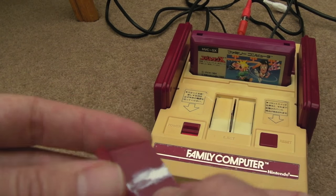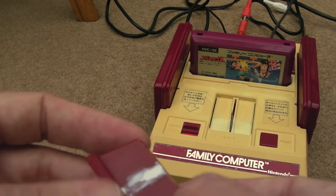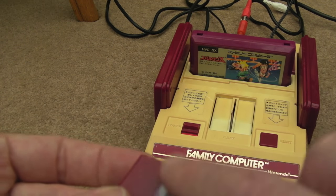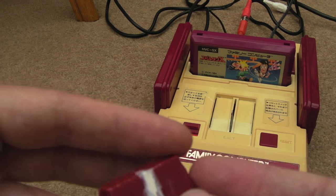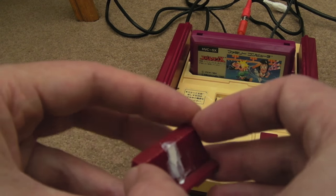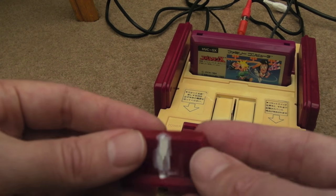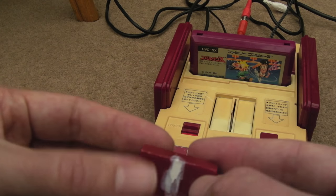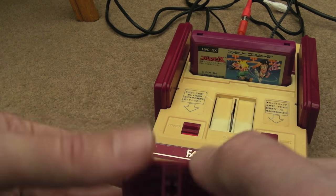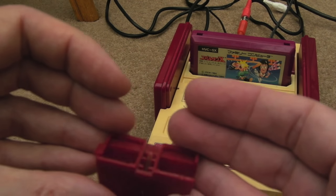Now these levers — the ones I've got all have massive chunks smashed down the middle. I've been filling them with some plastic putty, and then using plastic polish, all the excess bits around the edges will polish off, just leaving that white bit in the middle. There are a couple of options then — you could spray it or paint it, or get some red PVC tape and stick a piece on the front and the top. It's not going to look exactly the same colour, but it'll look nice and tidy. It could break easily because it goes right in the centre — so you need to do something there. There's not much more you can do other than spray it or replace it.